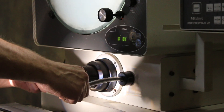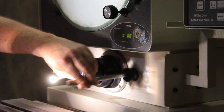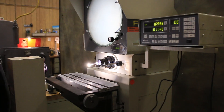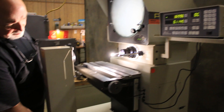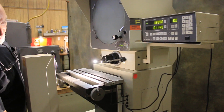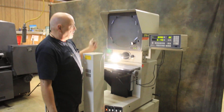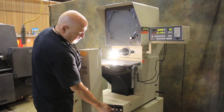These here are your fiber optic lights for surface illumination. These can be used when you need to look at the surface of a part — the surface finish, color, or texture. They can be used together or without the middle light, so you can look at the profile and color in some cases, or just the texture while leaving out the profile.